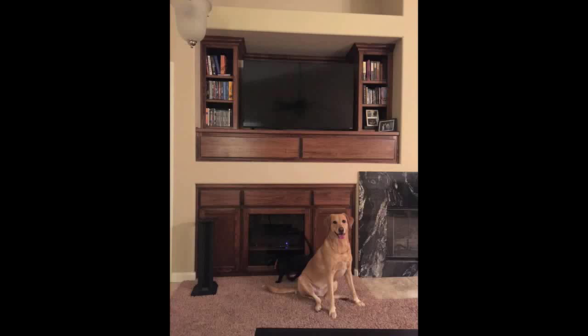He's concerned that if he puts the front left and right speakers at the same height as the center, they'll be quite far below the TV. I wouldn't do that — I'd put them a little above, basically at the same height as the wooden portion of the built-in. That puts them a little below the TV, a little above the center, just above the fireplace — and about as much above ear level as the center will be below, which is totally fine.